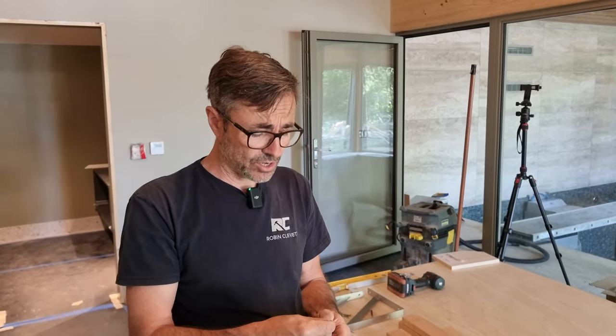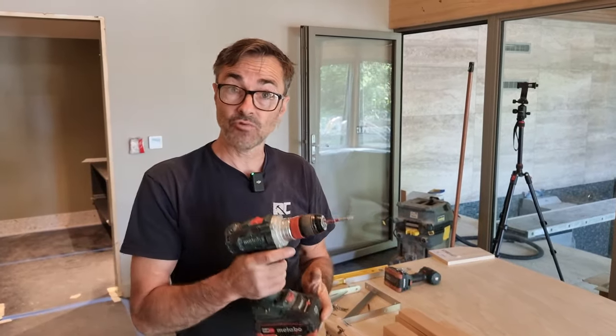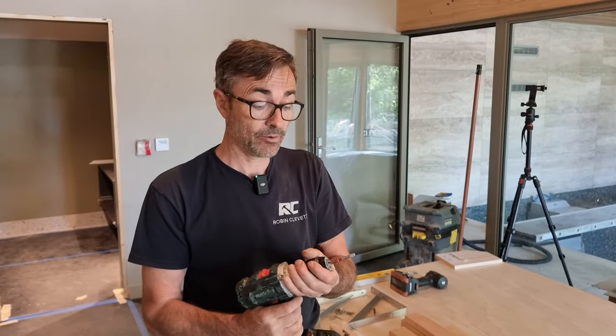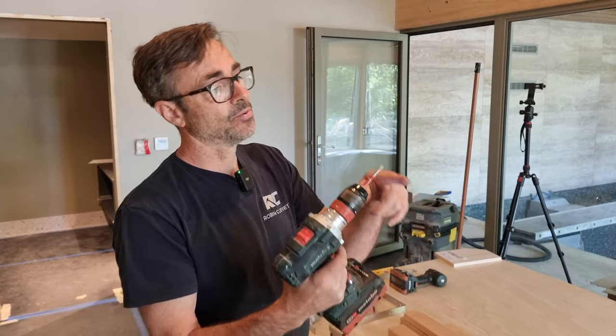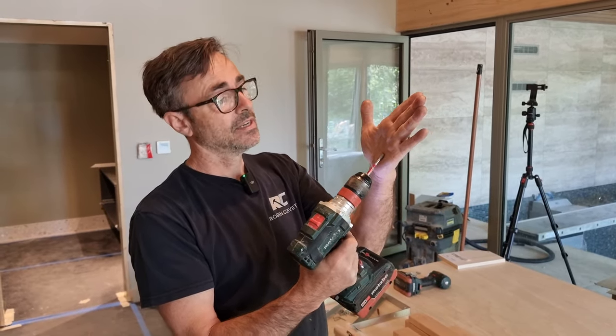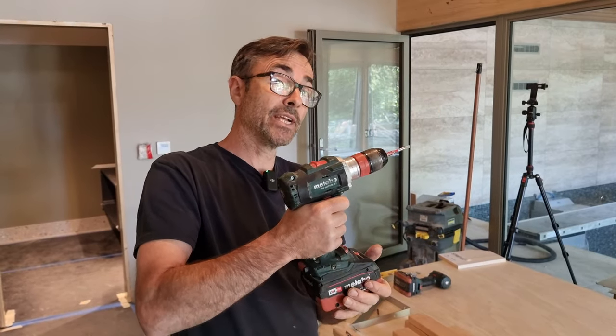They do say you can do these wet or dry, and you can get all manner of devices. You can even get these ones that fit on an angle grinder now. Indeed, I've got some bigger ones because I've done some 25 millimeter holes through the porcelain. They were really easy. But the idea is you want to start with the edge at about 45 degrees. And once you've started with the edge at 45 degrees, then you can slowly bring the drill up.